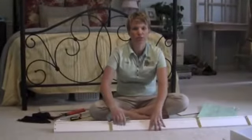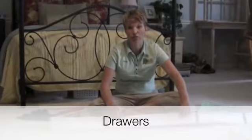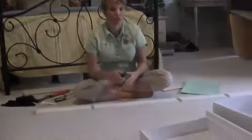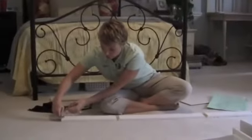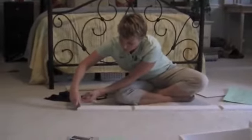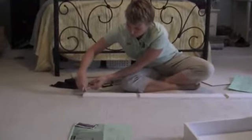The drawers are pretty easy to put together. They come in 4-inch, 8-inch, and 12-inch sizes. First thing you do is put a little bit of glue in the dowel holes, and you're going to want to have a wet rag handy because this can get a little bit messy. Then they've got these notches here, so we're just going to stick a little bit of glue on each of these.